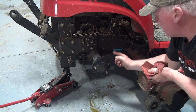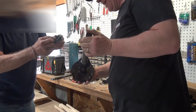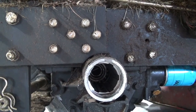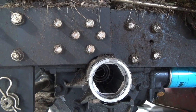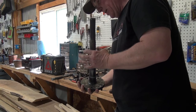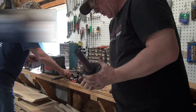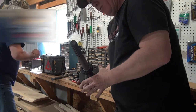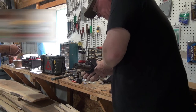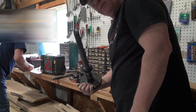I put a jack stand underneath for safety, then moved to the next step. I had to recruit my neighbor — this was way over my head once I found out the axle needed to be pulled out. The new seal is already on there. The seal goes on, then a snap ring, then a bearing, then another snap ring to hold the bearing on. To get the seal off, you pull the seal out, remove the snap ring — which is a two-person job — then pull the whole axle out of the tractor. Then you remove the bearing and snap ring and reassemble in reverse order.